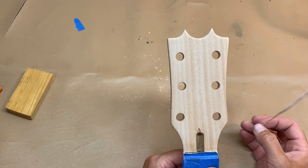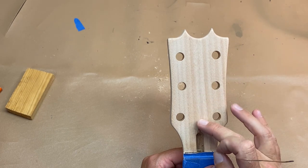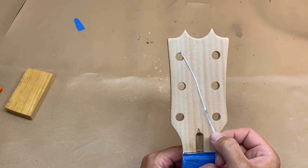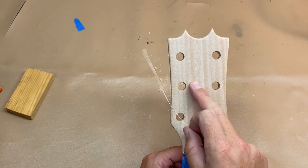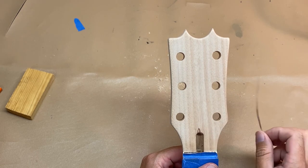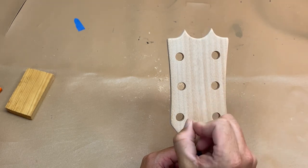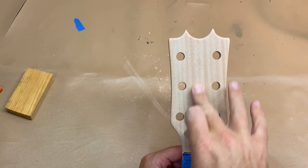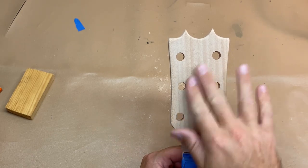The only unfortunate thing is I'm not able to do the inlay that I want to do with my silver wire. I'm able to pound the silver wire out flat, and I can make it fit the grooves that I would route in here, but it's not wide enough to fit down in there, give enough room for glue to hold without getting to the top of the body or the top of the neck and causing other issues.